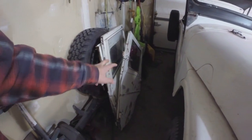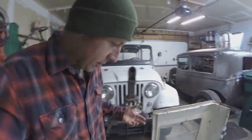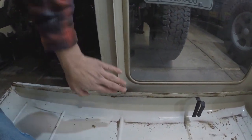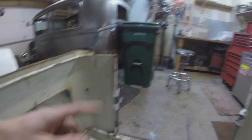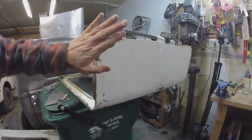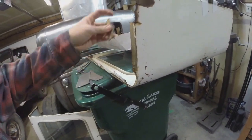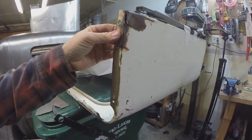I also need to break into the inside and grease up the tracks for the windows in the mechanism, because they're kind of hard to roll up and down. I've got my work cut out for me, but I'm going to get started. I'll just come in here and undo the bolts — at some point somebody welded the sides to the top just tacked there, probably to keep it from flexing. I'll cut those welds, unbolt it, pop those sides off, and get them over on the workbench to tackle the metal repair. All right, guys — she's all ripped apart. That was pretty easy, just as planned.